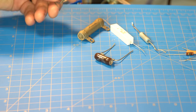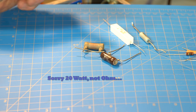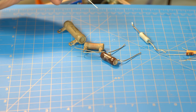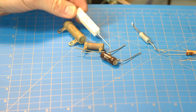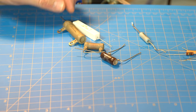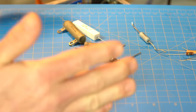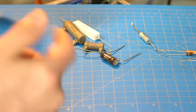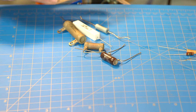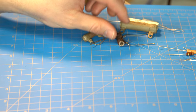There's also a brand I think is called Milwaukee — a 450 ohm, 5-watt. This larger one is a 20 ohm, and there's a Zycon 10W 130 ohm — a very standard cement ceramic resistor style. The way these all work is they wind wire in a coil around a core and connect leads to either end. For a certain gauge of wire and length, they know that equals a specific resistance, so they wind an exact number of turns to create it. That's why they're called wire-wound. These are used for power resistors — anything taking high current and high heat.